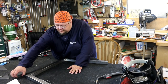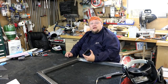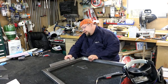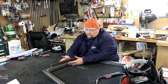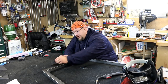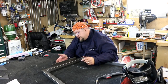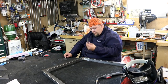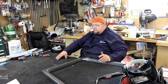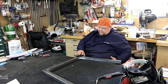I cut these plates out — this one is actually quarter-inch, which is what I happened to purchase. I bought a bunch of scrap flat bar and this piece here is going to get welded on. I'm going to cut or grind slots into it so you can slide a chain in to wrap around the log — that's what that plate is for. I also cut corner pieces that will lay on here. I'm not trying to win any beauty competitions, just wanting something functional I can use around the yard.